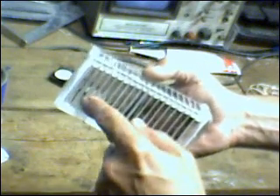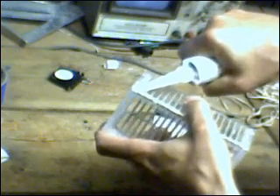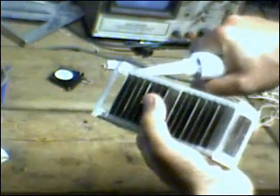When we come back, I'll have all of the holes drilled in the bottom and hopefully we'll also be able to show you the unit submerged in a tank of electrolyte. We'll be discussing how to prepare the electrolyte, how to precondition the cells properly for most efficient gas production, et cetera. I'm going to put a little bit more urethane adhesive along the inside — put a bead here just to strengthen that up a little bit. I want to make sure that this thing doesn't come apart. There have been a lot of stories on the forum about wives complaining that their little experiment is leaking all over the floor, eating through the hardwood. I don't need that kind of grief, so I'm going to make sure that this thing holds together very well.